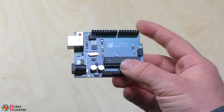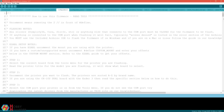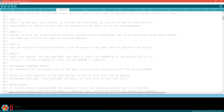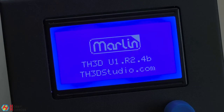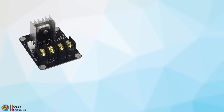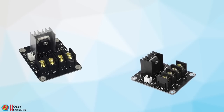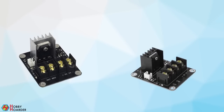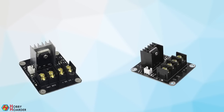You might need an Arduino for the firmware upgrade, as is the case with the Ender 3 or CR10. The CR10S has a different board and can be connected directly to your computer. Not only will it enable safety features, you'll also get better print quality and additional options such as filament changing, PID auto-tuning, and more. The second upgrade to prevent fires is to make sure that your printer has a MOSFET — a type of transistor that handles the high current for heating the bed. Without it, the board or the wires can overheat and catch fire. Some Chinese printers might already have one, but even then it might be underrated and you still have to replace it.